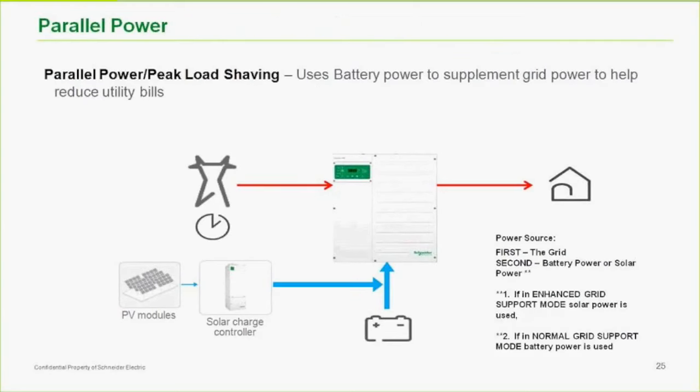Another way of using this AC input support, it's really the same function, just for a different purpose and under different circumstances, is peak load shaving, or what we call parallel power. What we're trying to do here is to limit the draw on the grid to keep the consumer out of a higher tier level